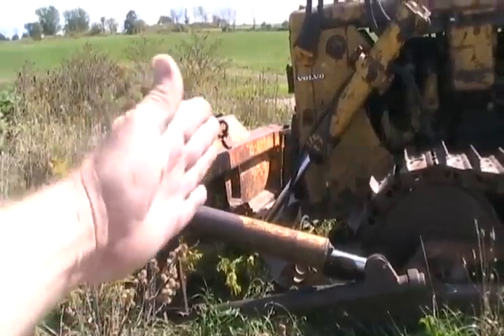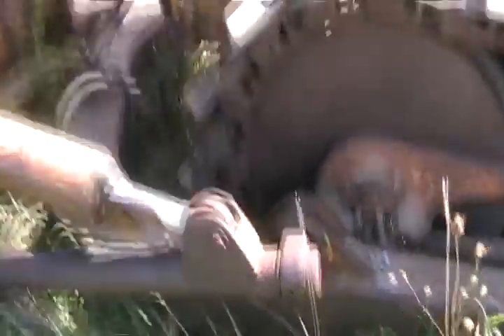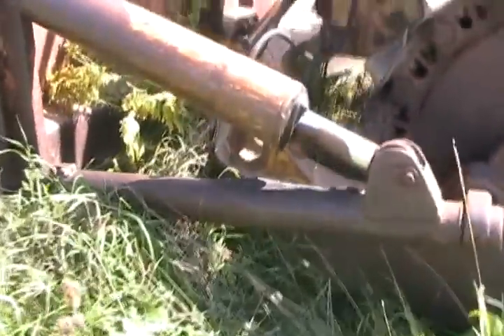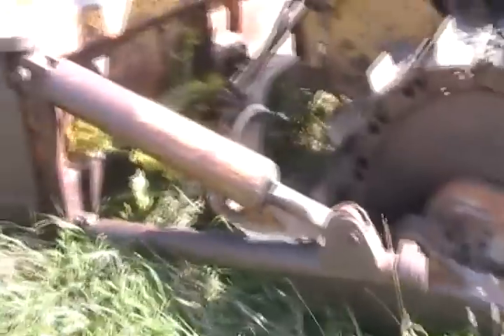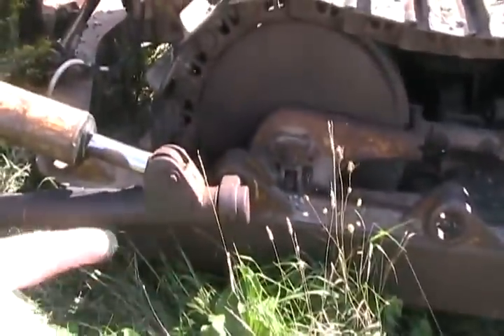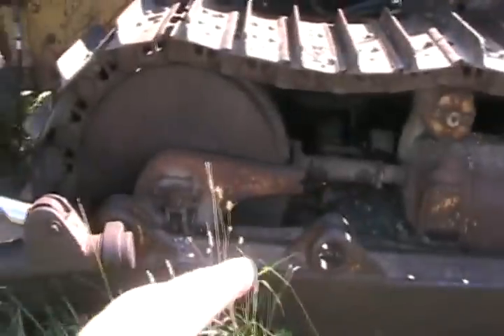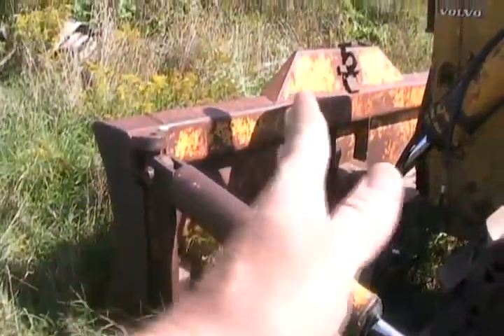If you want to make it six-way, that's manual — I'll show you how to do it. The last two ways is moving the blade like an angle plow. It's actually not very hard. You just pull that pin out, and it's got three different holes. All you do is lift your blade up a little bit, pull the tilt lever, tilt one corner until it catches the ground, drive back and forth, and that'll cause the blade to catch the ground and pull it one way or the other. Then you put the big pin back in the collar on each side, and you've got an angle tilt blade or an angle plow.